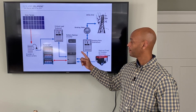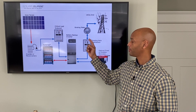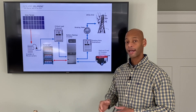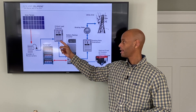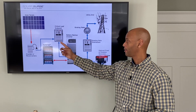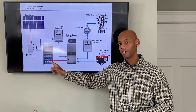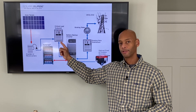On the utility side, your hybrid inverter is going to have a separate utility connection, which you can connect to your main panel or main service. Built into your hybrid inverter is an automatic transfer switch. On a normal day, your battery backup inverter is just passing utility power straight through into your critical loads panel, or if the solar is producing more, it'll pass the solar power back through to be sold back to the grid. But if utility service goes dead, internally it'll activate its transfer switch, start pulling from the batteries, inverting, and it will send its own signal into the critical loads panel.